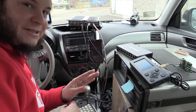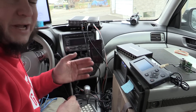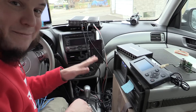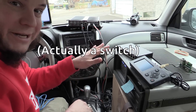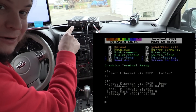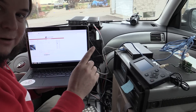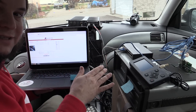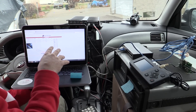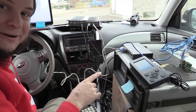We've got a static IP set, though I still can't ping it from the laptop, so the networking through this Inmarsat modem is really frustrating. It's possible this rig needs an artifact from the ancient past known as a crossover cable. Modern networking equipment doesn't really care about cable configuration because it can auto-negotiate, but it's possible both the modem and the Teensy ROM are too old for that. I could make a crossover cable but I'm too lazy — I already have a hub nearby, so we're just going to hook that up. That did it! The equipment was just a little too old, and now with a hub in there we actually have a connection from the Commodore to the modem. I've provisioned 192.168.1.102 and we're trying to activate a 64k streaming connection — that is now activated, so theoretically the Commodore should have internet access through Inmarsat.